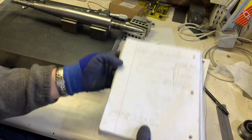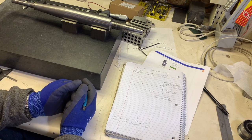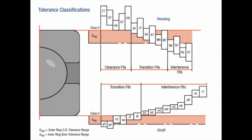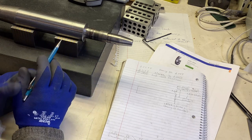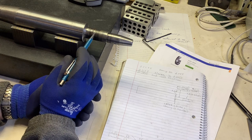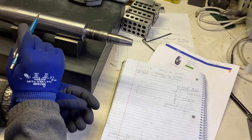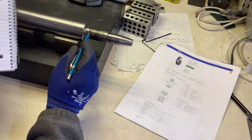I'll put up a diagram I found online - very helpful, gives you a visual of what the differences are between all these different fits. One of the primary objectives of this exercise was to make sure that this area here, which was clearly damaged and had been reworked by somebody not very successfully, met either the J5 or the K5 fit - and it simply does not. Let me show you a diagram of basically what this thing looks like; the sizes simply don't fit.